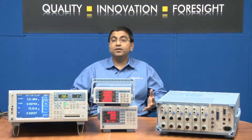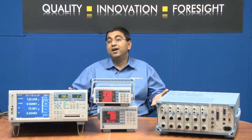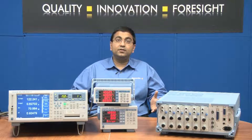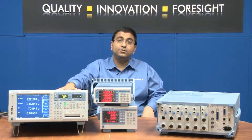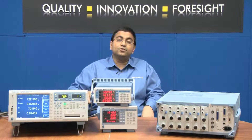There is no other device between the signal and the measuring instrument. Therefore, higher accuracy and precision are the natural outcomes. Not to say that there are no other accurate external shunts available in the market — of course, there are. However, when you are using such an accurate power analyzer, why would you introduce a device in between and degrade the overall accuracy of your measurements?